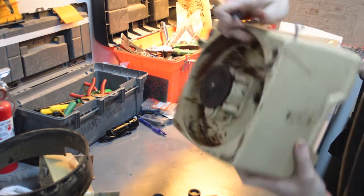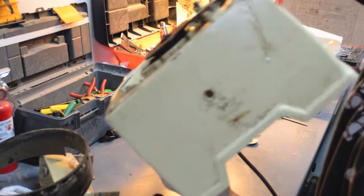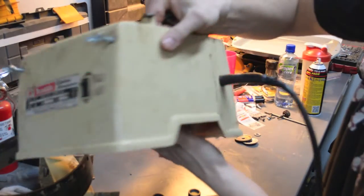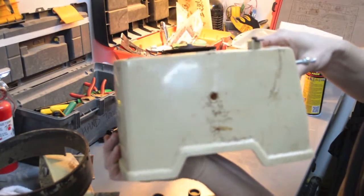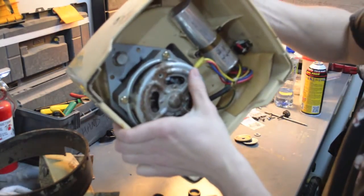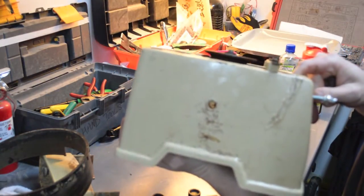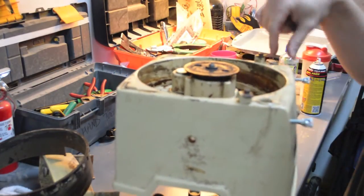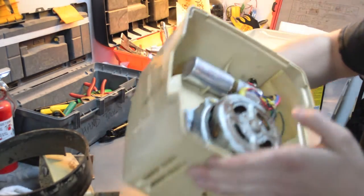The only issue is you've got to be really careful not to over tighten it, or you'll develop these stress cracks, because it's really just plastic pushing on plastic, and when I got it, it was already cracked. I tried to fix them as best I could with some more epoxy, but it's inevitable with this body, just the design of it. Somebody had just over cranked it, and it's a very common issue with these. So when you get one, make sure you look at that, and you'll probably see cracks, but if they've been repaired, and if these actual screws hold the pins in place, then you're probably okay. But in my case, I felt like I had to be a little bit more creative in solving that issue.